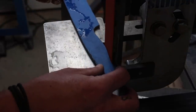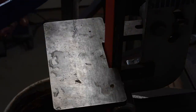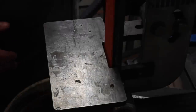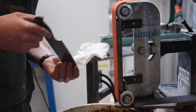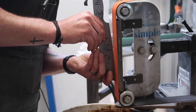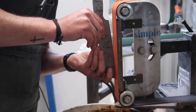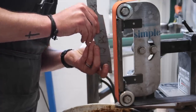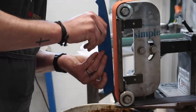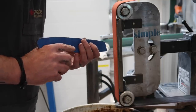Once we've got that cut out, we'll clean up the profile of the blade with the flat platen and my work rest. Once I get that part done, I'll take off my work rest and, still on the flat platen, I kind of like to just gently massage some of those larger radiuses — the belly there. I find just rocking it back and forth in the flat platen like this does a really nice job at smoothing it out. I'll also do this on the spine — anywhere you've got a gentle radius, you can really control and get a nice smooth, organic sweeping transition.